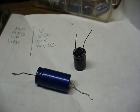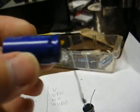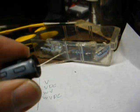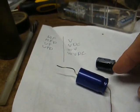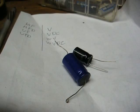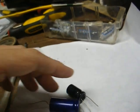When ordering new capacitors, there are two basic styles. Axial lead capacitors have one lead coming out of each end. Radial lead capacitors have both leads coming out of the same end. I usually order radial lead capacitors because they're cheaper and more common, though there may be some applications where axial leads are easier to install. Both types are available.